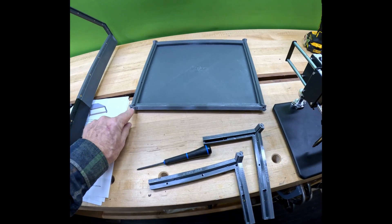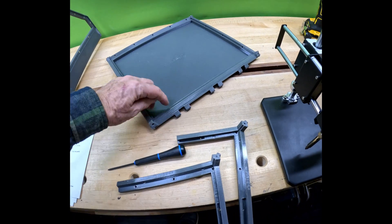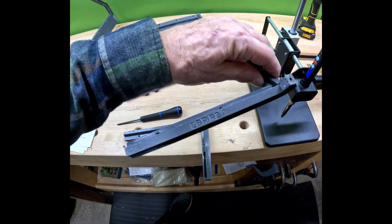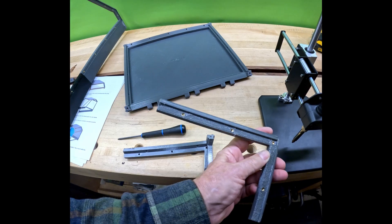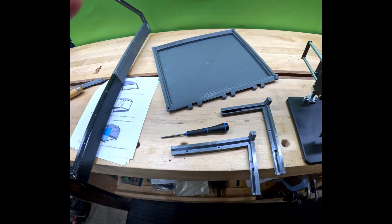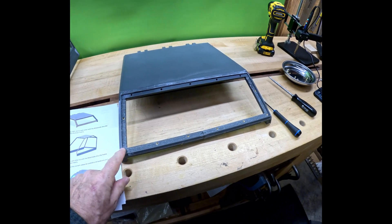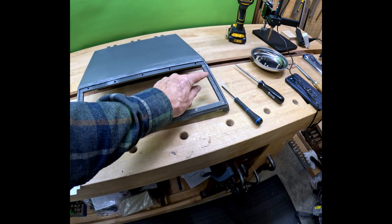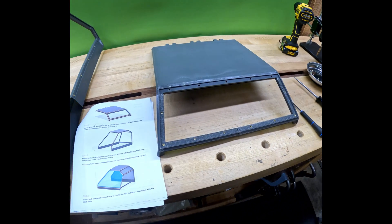We need to add a few more heat set inserts into each of the corners of the top — you can see this where the hinge is. Each of these gets one. And on these pieces, CBR and CBL, they get one here as well as these areas here, so we're going to put one here and here in all four corners of the top. Step four is completed with the CBL and the CBR. There's a heat set insert in here, here, and here. We've got a screw going here, here, and across here.